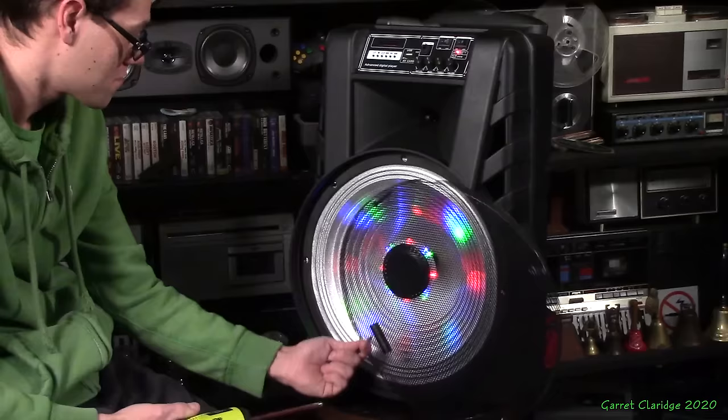Okay, so I went ahead and took apart this piezo tweeter so we could see what's inside. And it starts off with this baffle. Here, that would go inside the horn. Next, you could see a diaphragm in there, and I already kind of ruined it. And underneath there is the piezo disc. That is typically just a little buzzer noise. So this would vibrate and run this cone.